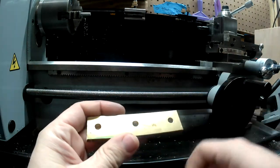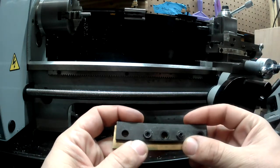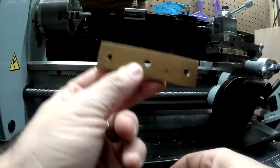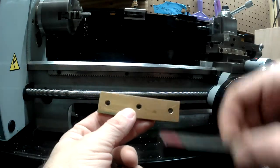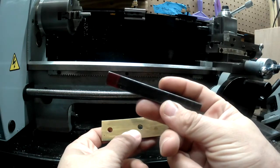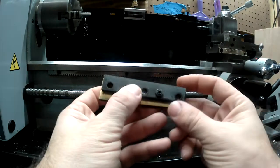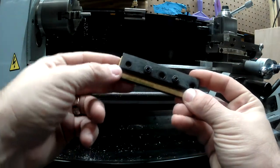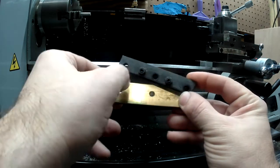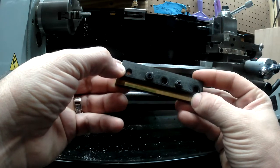This is basically already laid out for us. This could all be accomplished with just basic hand tools, two pieces of brass, one piece of square cold-rolled mild steel, just cutting the brass, recreating the existing gib strip, drilling the larger holes on the drill press. Very, very simple stuff.